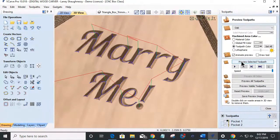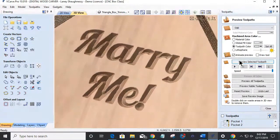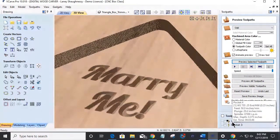And when we preview that toolpath, you will see that we'll get much more definition in that cut. And I want to be careful, 20 thousandths of an inch was a little much. I mean, small numbers, the deeper you go, the wider that V bit gets, right? Now that's alternative number one, adding start depth. Alternative number two, use a narrower V bit. So let me give you an example of that. Let's go into the V carve cut.